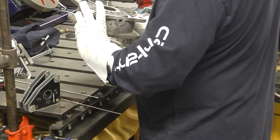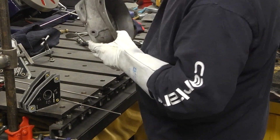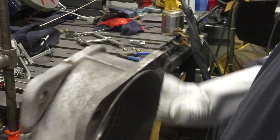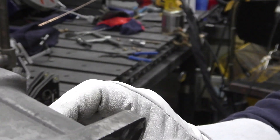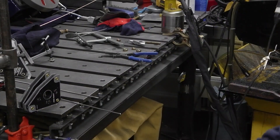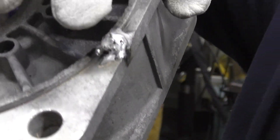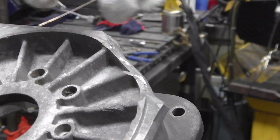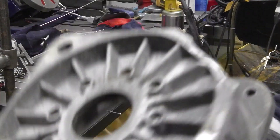Let me give you a little close-up of what I've done so far. I've got to get all the way around here - I've carved it out pretty good with the grinder, cleaned it up with some acetone. I've got to get in there and fill all that big crack. I can't do this side because it's got some tolerances I have to worry about, and then I've just got to grind these pieces off here, because it's got a follower that falls inside some sort of transmission or something.